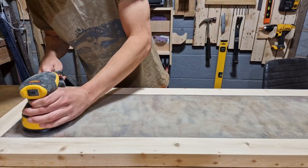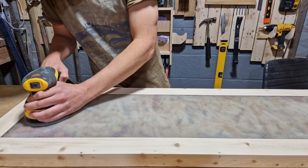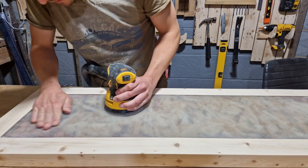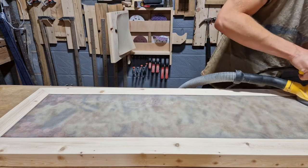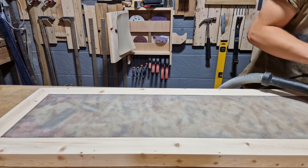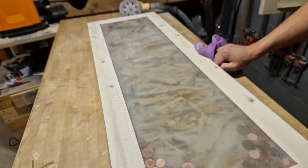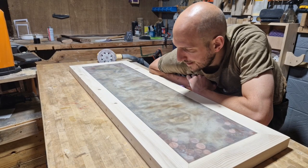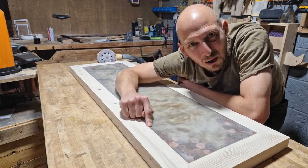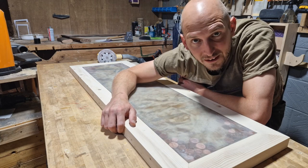Now why is that such a deal? Well, number one, epoxy isn't the sort of stuff that just wipes off. Number two, that sets things down one millimetre less. I've never really tried to sand epoxy, but I know for a fact sanding through one mil of epoxy just to get everything level is going to be a sad old time. But still I persevered - I went through the grits and went up to 400, which is the highest grit I've got. When you wipe away the dust you can actually see through to the chipboard, which is a good thing I think. I've got some swirly marks on here but I'm hoping they disappear as I go through the grits.